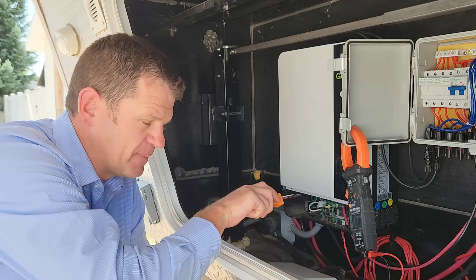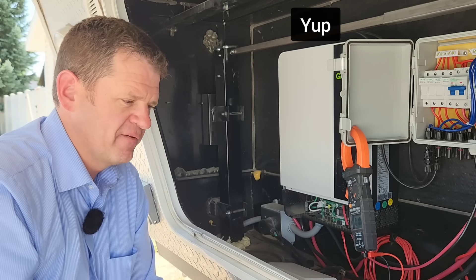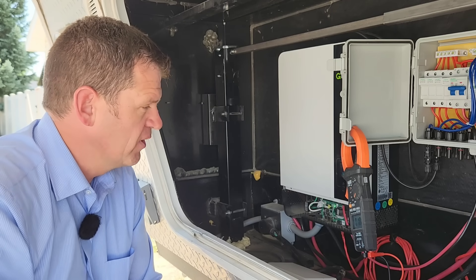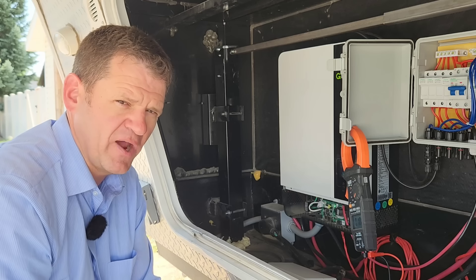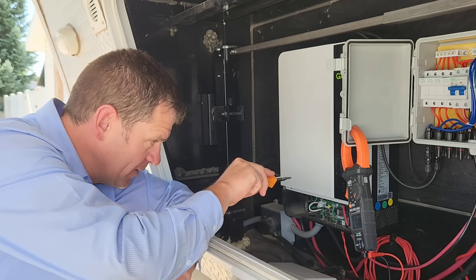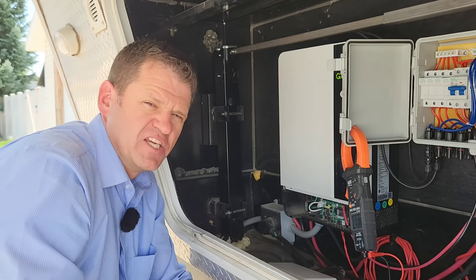I figured I'm just going to tighten this PV terminal really quick. To prevent electricity from going through your chest and heart, I've heard people say just put one hand in your pocket or behind your back while working — that rule didn't really help me here. I was really tired; you do stupid things when you're tired. I covered the solar panels with a towel, came down, realized I had a solar disconnect in my combiner box, totally disconnected the power, and figured I'm just going to tighten this one screw — nothing can happen, right? I tightened the screw and it shocked me straight through the chest.